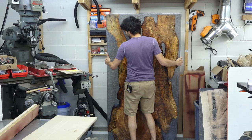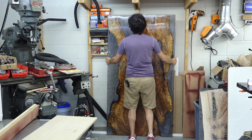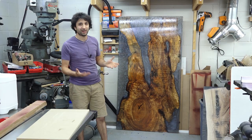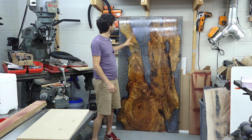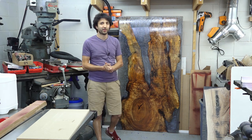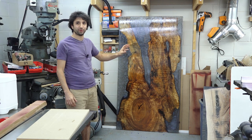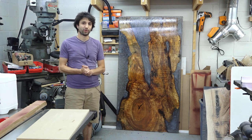One of the questions was how much does this thing weigh? And I have no idea, but it is pretty darn heavy — it probably weighs as much as a dense hardwood. Most of the common questions center around one theme: how is it possible to pour this thick of an epoxy layer in one go without it overheating? And that comes down to the epoxy we actually use. For a slab like this, you want to do it all at once — you want to use a deep pour or a slow-curing resin.